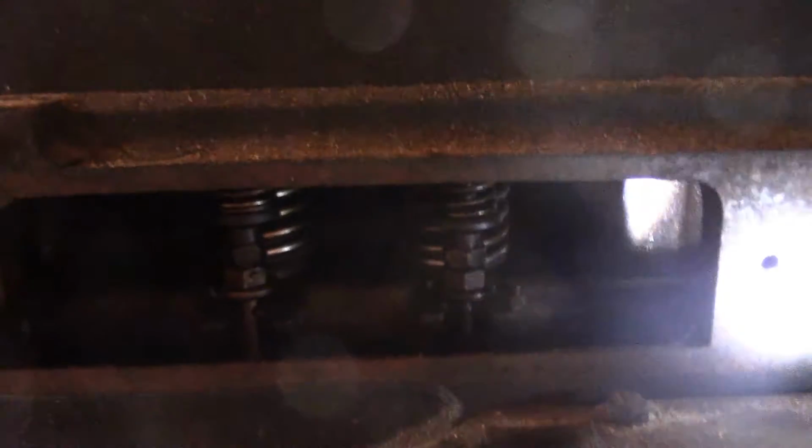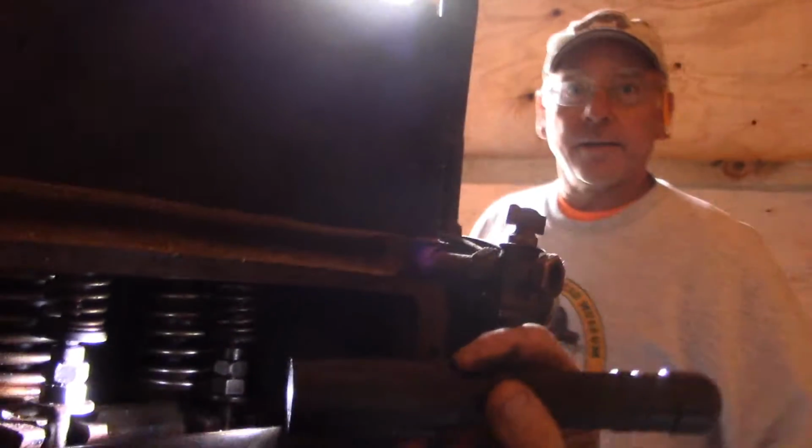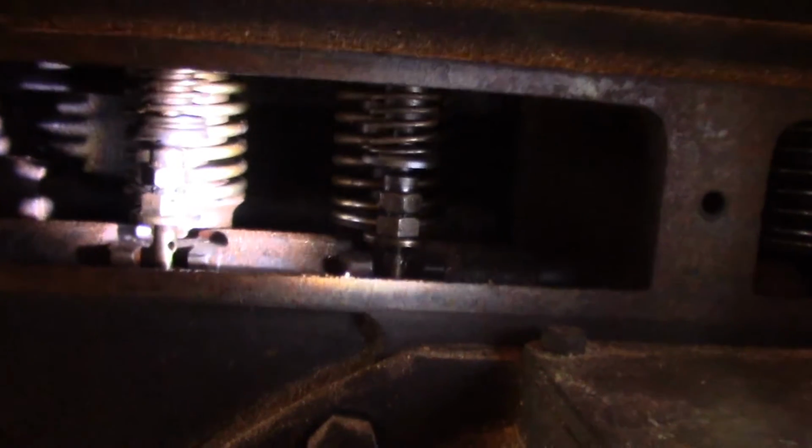Yeah. Now, does that hold the fuel off while it's doing that to 1 and 3? No. No, it just fires anyway. It's totally separate. They will function pretty much all the time. Yep. Okay. Unlike the Atlas where it holds the fuel off on that one cylinder? No, well, Atlas does it on all 4 cylinders, so you just pull the fuel rack back and it's getting no fuel until you're ready to spin it up and then give it a go. Uh-huh. Yeah. So it only has a little bit of spinning on its own to fire off once you engage the fuel.